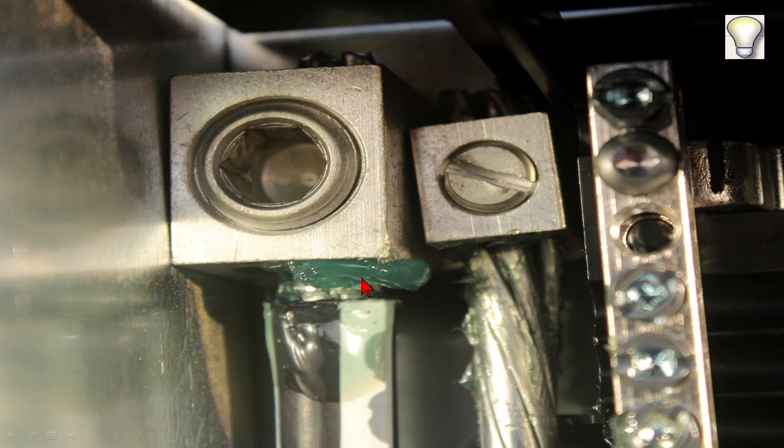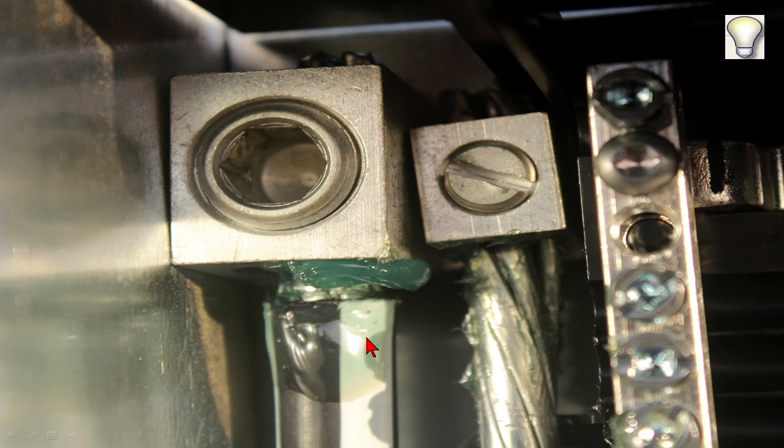And by the way, you don't want to put that on batteries. Yeah, bad idea. I thought this is so good for aluminum, and I was changing a battery and put it on my battery. About two days later I had a dead battery. I guess it becomes an insulator when it gets on the lead of a battery. Don't put it on a battery of a car. I'm just telling you that. So today, aluminum wire is designed not to need any Penetrox.